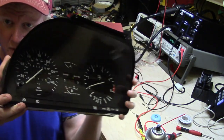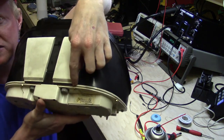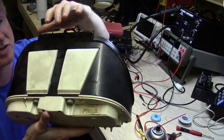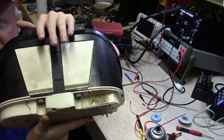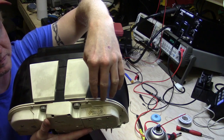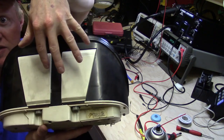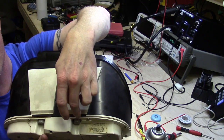That's basically the gauge pod all back together. One thing I noticed when I took this apart — there's a gap on one side. As you tighten this back up, just make sure that you do it in a criss-cross pattern starting from the center. Obviously getting this back together, this joint ended up being perfect. I think that's where a lot of the dust and things come from — it actually went in through here. The top of this unit is really dusty, and it just kind of goes down into the crack that was here.